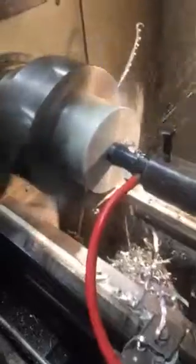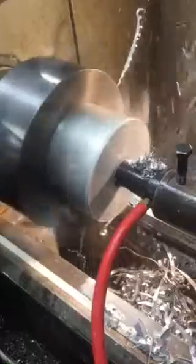That's three inches thick, too — it's aluminum. Peels it out of there real nice. All I'm doing is punching holes so I can finish bore it with a boring bar. I gotta have enough diameter hole so I don't have to take out much — maybe another quarter inch. There it is.